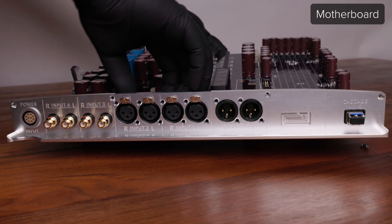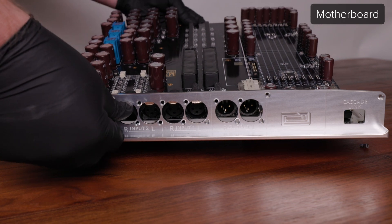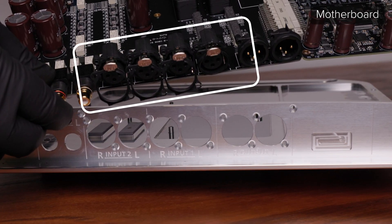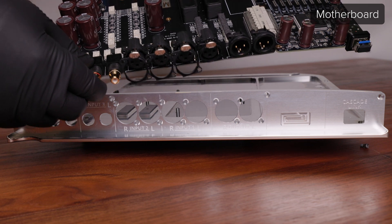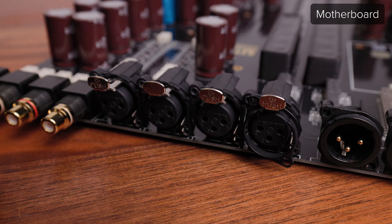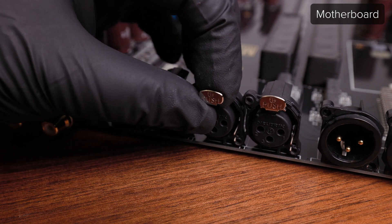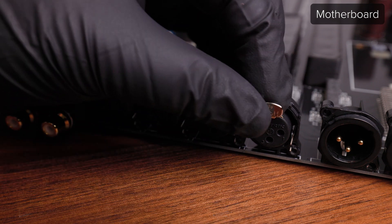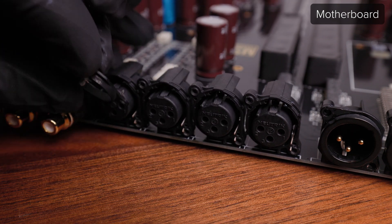Now that the board is free, lift the back edge and then clear all of the connectors from the jack panel. This will pull out the XLR release tabs and start to remove the metal retention rings from the XLR connectors. This is unavoidable and is not damaging your product. Now remove the XLR tabs by pulling off the metal rings around each of the connectors before pulling the tab out of the front. Re-seat the metal ring back on the front of the connector with the small cutout facing upwards.